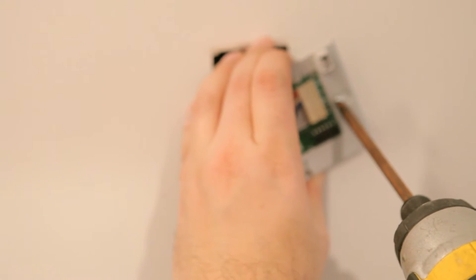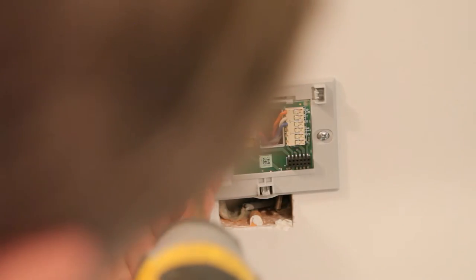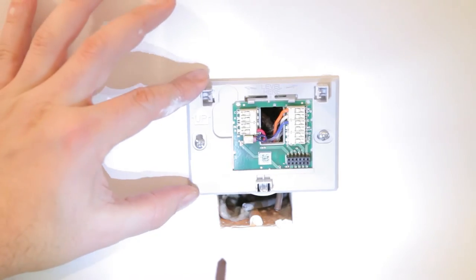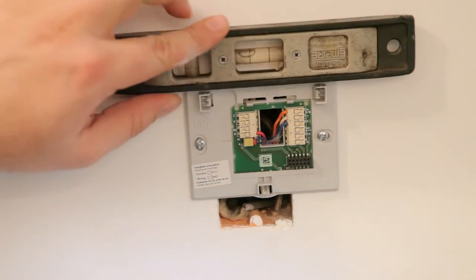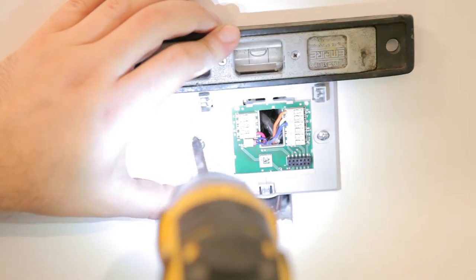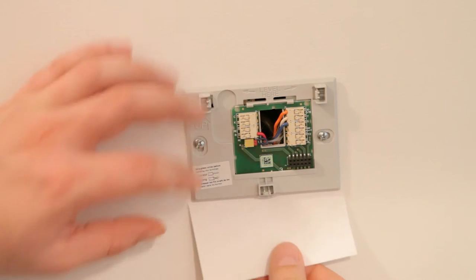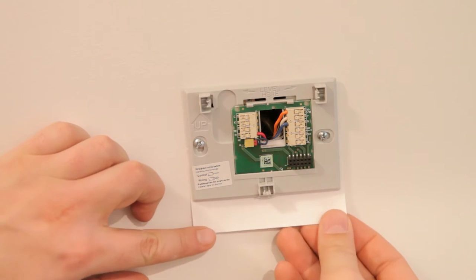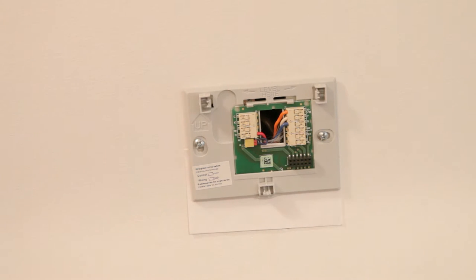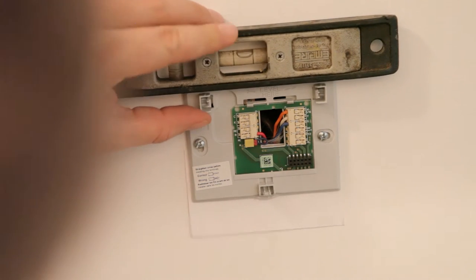I found the rough position of where I wanted it on the wall, got my first screw, and drilled it in. The mounting plate comes with two different holes — one that lets you level it and one that lets you shift from side to side. Once you've got it positioned, I took a small level and made sure it was sitting right. I started the second screw, got it in a little snug — just enough that I could still move it — checked for level again, and then screwed it down tight. I then cut a piece of thick paper just large enough to cover the bottom of the mounting plate, wedged it in behind the plate, and had the screws pull it down tight to keep it in place. I checked for level again and tightened everything down.